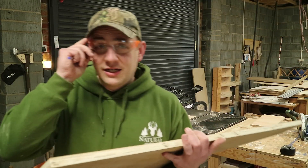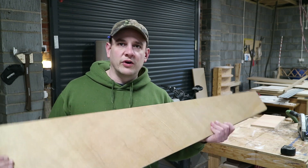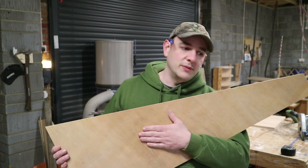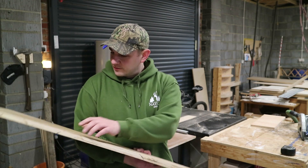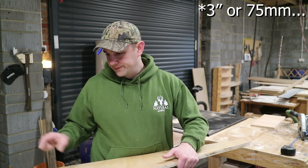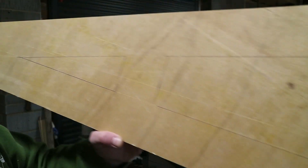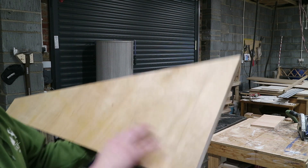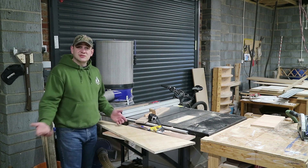This weighs about 3 kilos, and it's a toss-up between the additional weight — which means it's going to move around less — and the additional weight, which is going to provide extra strain on the hinges. What would you do — would you skin some material out of this just to give it a fighting chance? Because it's going to be 6 foot long and it's going to create a massive lever effect. I think I'm going to go 4 inches in — leaving that much at that end and chopping it all the way back up to here. That gives us a 75mm base. My only concern is if it's going to twist.